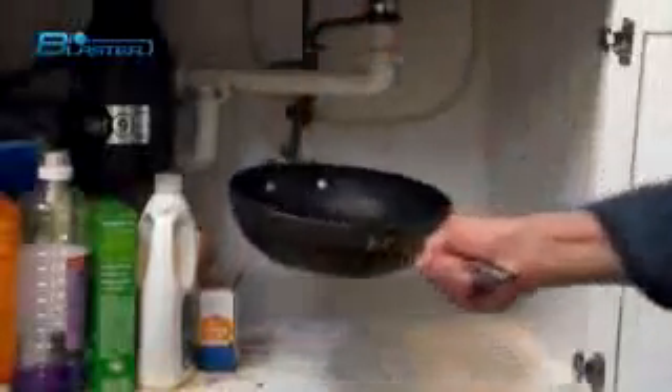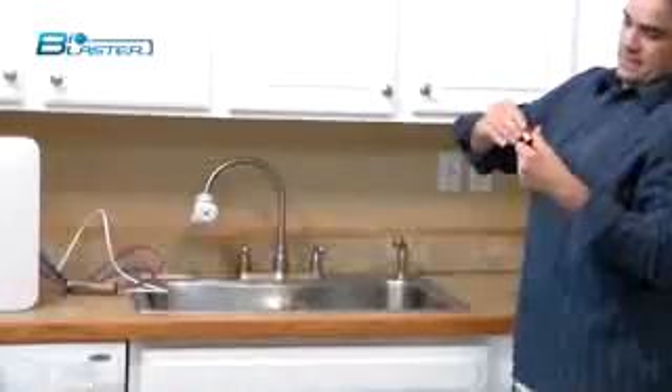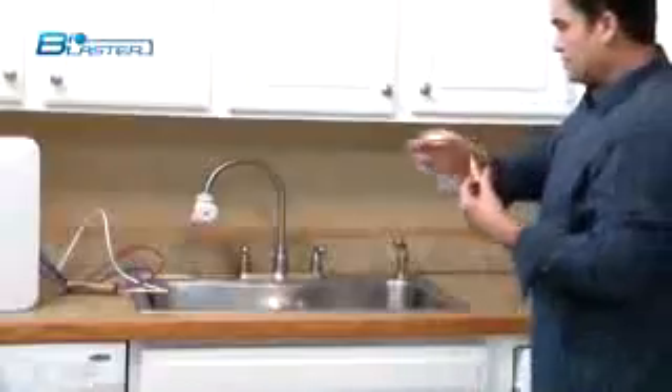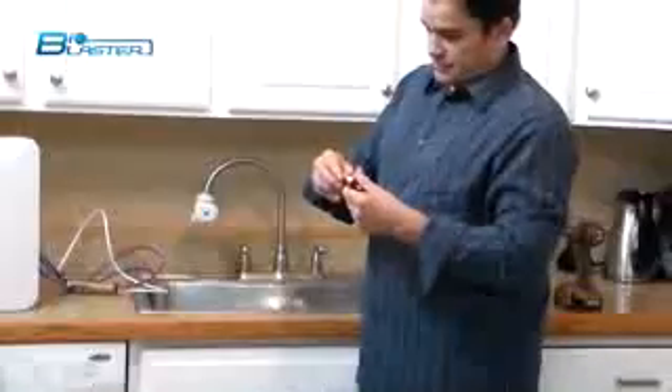We're going to make sure this fitting is good and snug because we don't want any water leakage. We'll put tape on our old fittings again so we can put this all back together. Now that we have our inlet connection with the shutoff hooked up, we can remove our drip pan that held all that water that dripped out of the lines. We've sized the Christmas tree bit with the nut that goes on the bottom of our faucet, so we know exactly how deep to drill our hole.